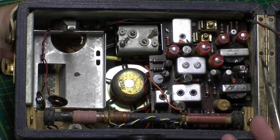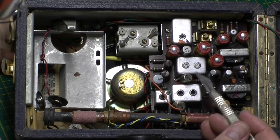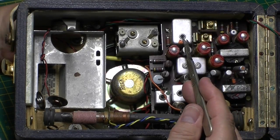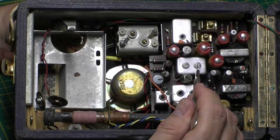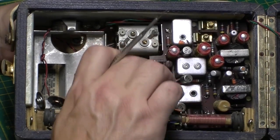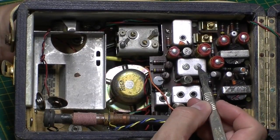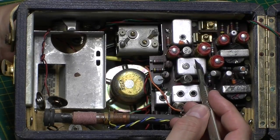So we've got audio transformers on these, ferrite rod aerial, long wave, medium wave set. We've got these horrible plastic IF trimmers. Strange actually that we've got ferrite normal ones, and then smack bang in the middle we've got one with plastic tops to the slugs. I've had one of these before that John on the workbench today repaired for me, where the slug had actually come away. These plastic tops had been gnarled to hell. Right mess it was.